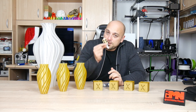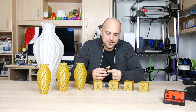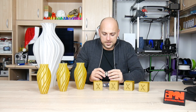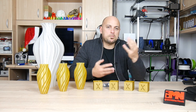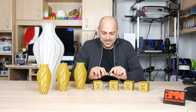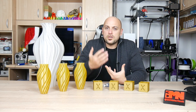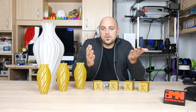To be completely honest, even if the DIY smoothers worked flawlessly like the Triangle Labs ones, unless you have everything available at hand it's not really worth the hassle. To buy the prototyping board, cables, diodes, and everything — not to mention if you don't have a soldering iron you'd need to borrow or buy one. To do three TL smoothers myself I spent possibly about $20-25 in total with postage, while the Triangle Labs set was like $15 for three — so it wasn't even worth the hassle. It took me about an hour and a half to two hours to make three of them. For the Little Monster you do need three because it's a delta. For other printers like the Tornado you might only need them for the X and Y axes, but personally I suggest just going for all three axes straight away.